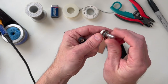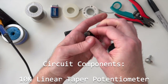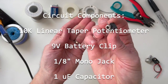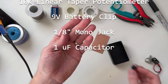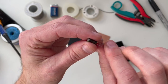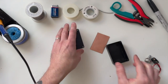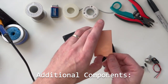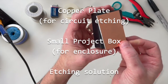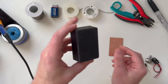He goes through everything you need. First is a B10k pot — this one has a center detent but that doesn't really matter. You need a nine-volt battery clip, a 1/8-inch mono jack (you could use a quarter-inch if you prefer), and a one-microfarad capacitor — either electrolytic or disk style, it doesn't matter. You also need a circuit board to etch, and I even had this little project box that is almost exactly the same size — just stupid luck.